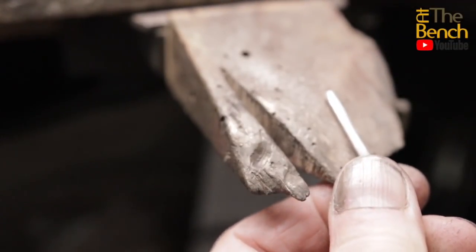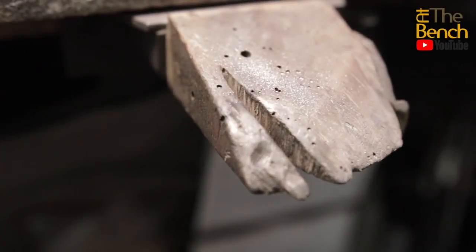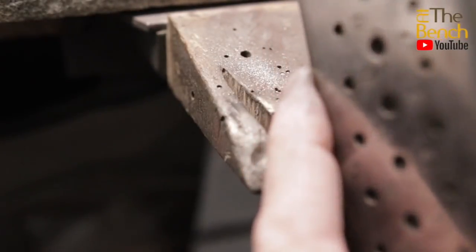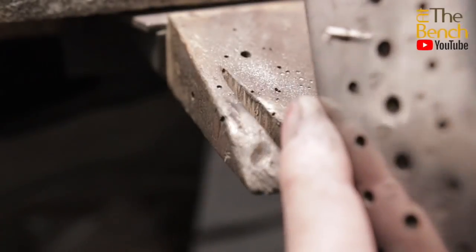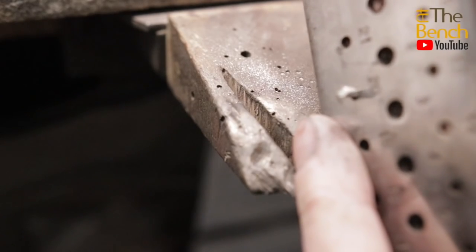You can hammer and then you grab your draw plate again. And that will actually go through like that. And then you can start to pull it through. It'll go down through the 20 as well. And you can now pull that through with your draw tongs.